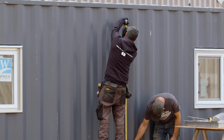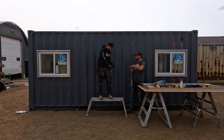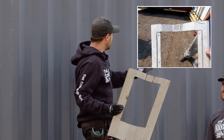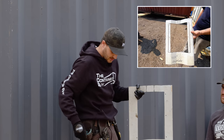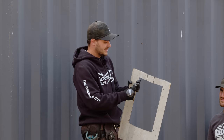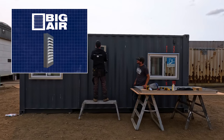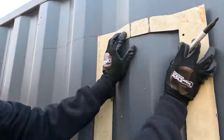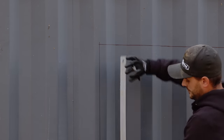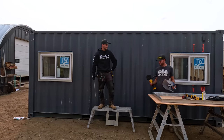I got them all marked. And if you've ever done any container mods before and you have any scrap corrugation, you can use flexible rulers or whatever to transfer your line across, but this just works so great for us. If we've ever cut anything nice and straight, we can utilize it as our marking template — you'll notice a hole in it, that's for our big air 45 vents. Next step: grab a face shield, angle grinder, a guard, gloves, and a cutter.